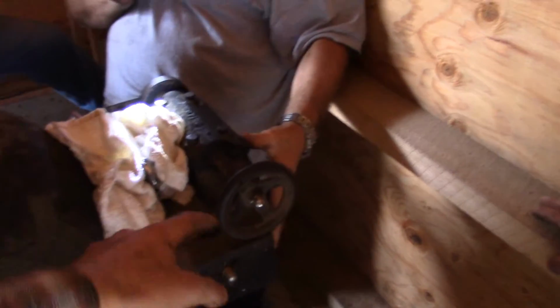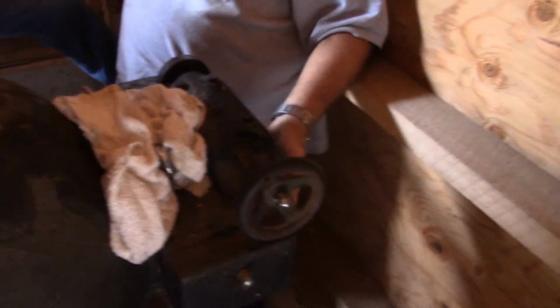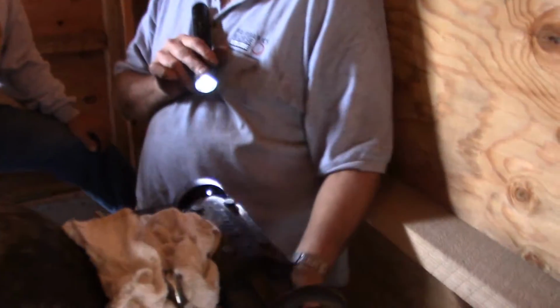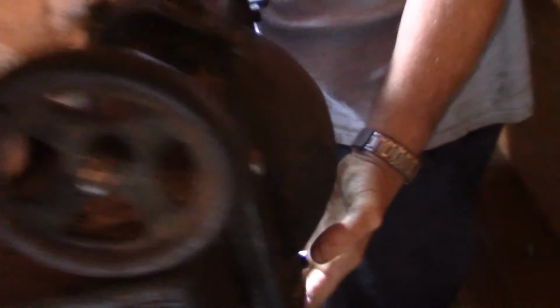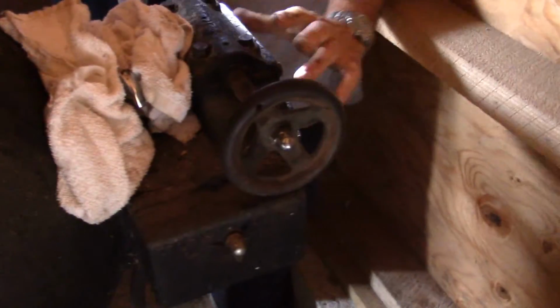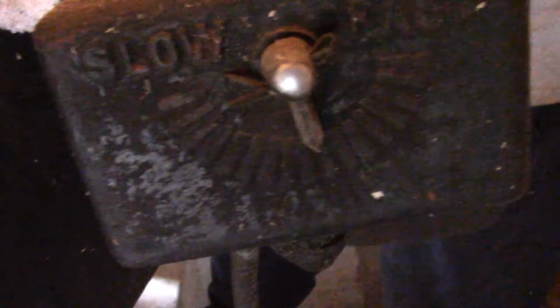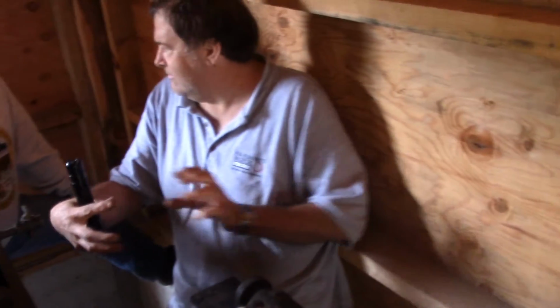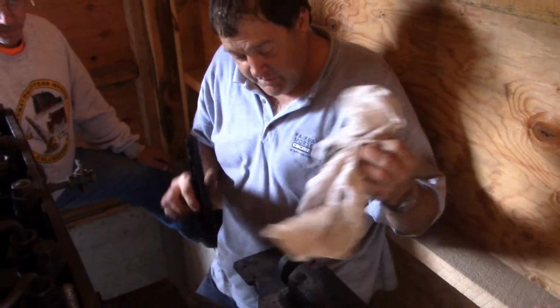So as you're turning that, is that adjusting the RPM? What you might want to do is pull this end cap off. That's a simple gasket. What you probably get is water and oil out of here. This is a little chamber itself. So you probably expect to get oil when you break that gasket. There's no drain plug in it. And you'll find a big brass gear in there that's part of the mechanism that's worn in pushing. And there's a slip arrangement, and it's got to have a spring behind it one spot or another to make that all work.